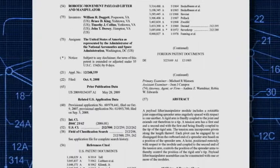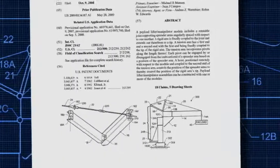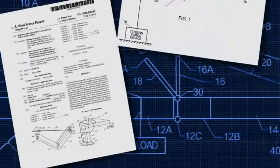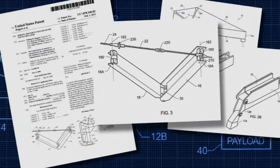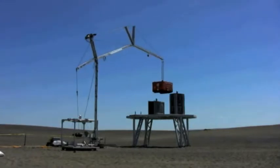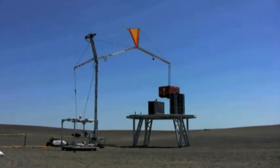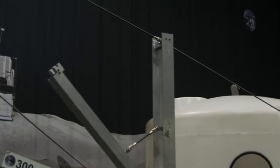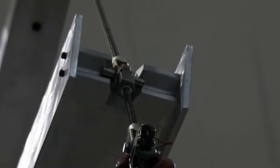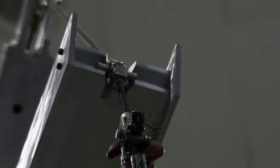The LSMS is a completely new concept for a long-reach manipulator, invented specifically for doing work on other planets. The LSMS links and cables maintain a series of structurally stiff and strong triangular shapes throughout its full range of motion. Along the tension actuation cables are a series of pins that automatically engage and disengage from special grooves located at the ends of the spreaders.